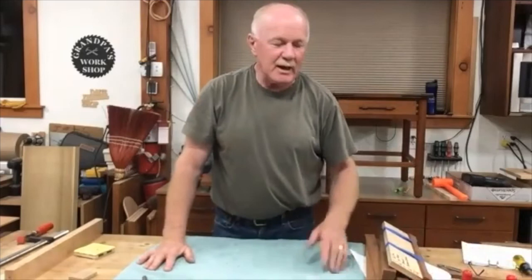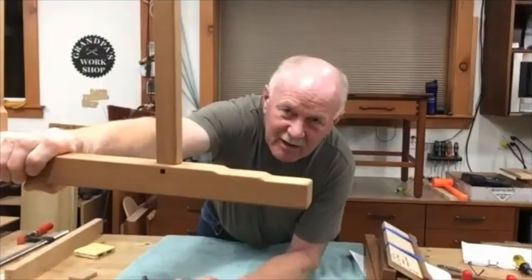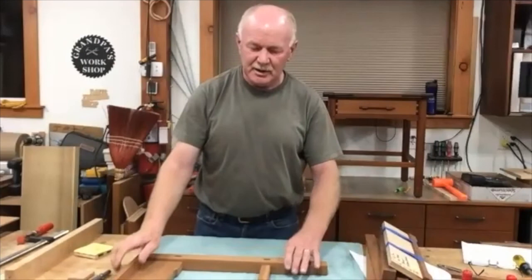And especially if you're going to do anything like on legs, chair legs, or like this right here. Oh, yeah, of course. See, that's an inch and a half thick. Yeah. So you can't do it with that bit. You need a 2-inch cutter in order to do that step. An inch and a half is a pretty common size for things like an end table, nightstand, coffee table, sofa table. Sometimes you'll go more to an inch and 5/8, but that 2-inch cutting length is well worth it.